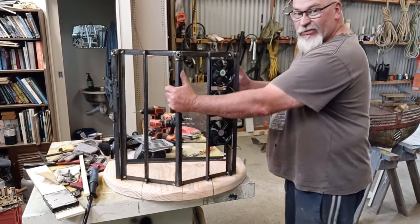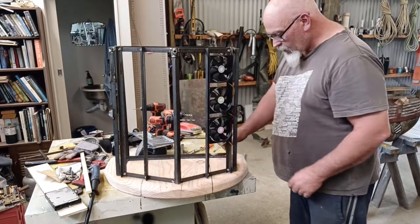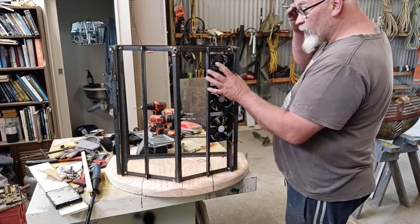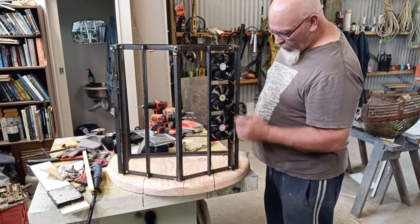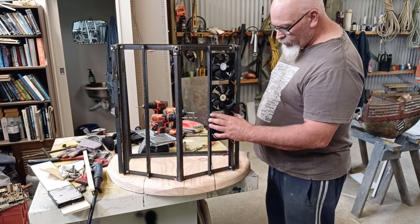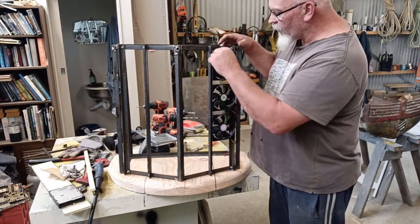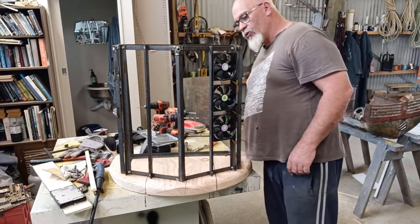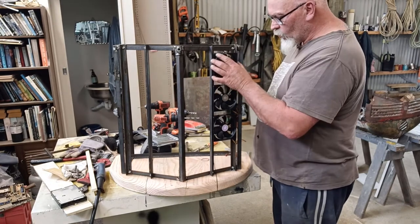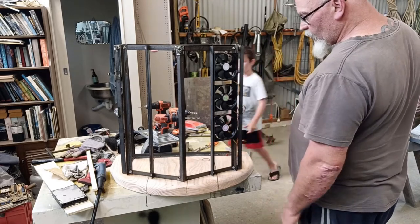Anyway, so there's three fans in there, all ready to go. Obviously not permanently in there, but all screwed. I screwed these holes very slightly larger, so I will enlarge these ones because this one here was distorting slightly, so obviously the holes just aren't lined up perfectly. It was distorting, and this one didn't stop spinning, so the back screws off a little bit. If I enlarge those holes, it'll just give it a little bit more relief to get it closer to the dead center for each one.